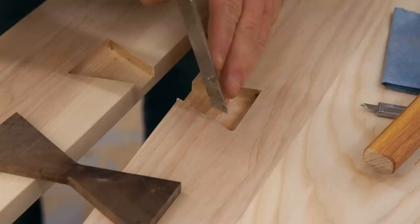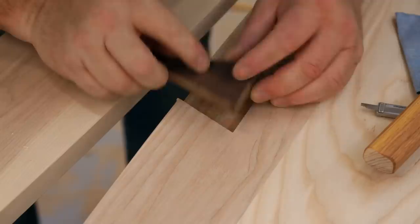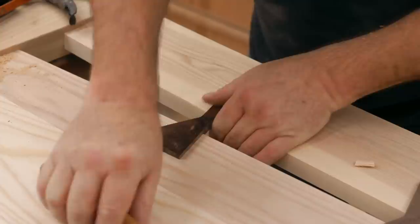Because I'm using a round bit, this leaves me with round corners. There are two ways to handle this: I can either round the corners on the bow tie inlay, or I can chip out the corner on the recess. For this I think the sharp corner looks better. Since these are mostly decorative I'm not going overboard gluing them in — just want to make sure they stay in there — so I'm going to put a spot of glue in each pocket and then tap the inlay in.